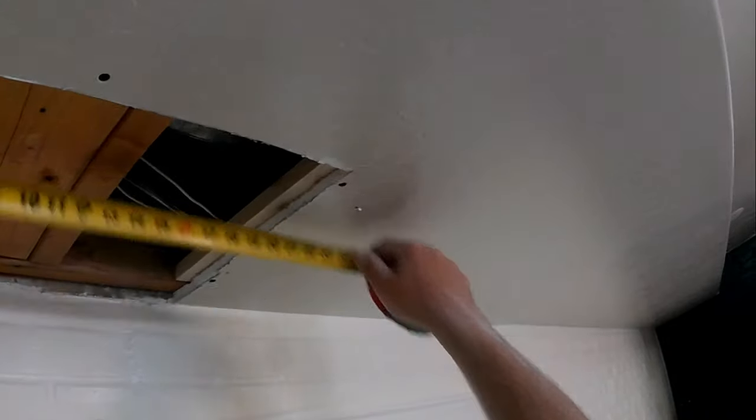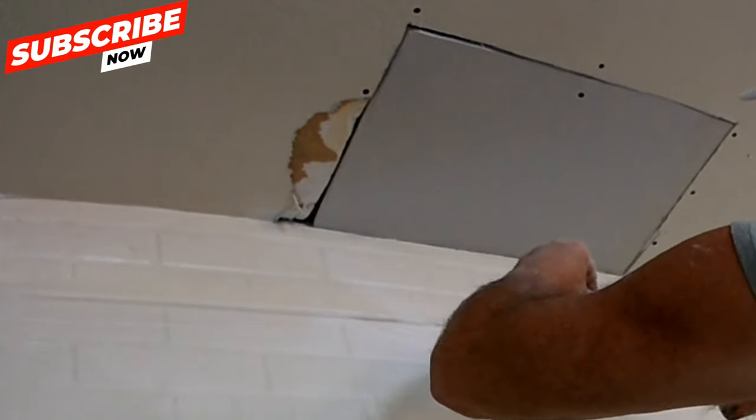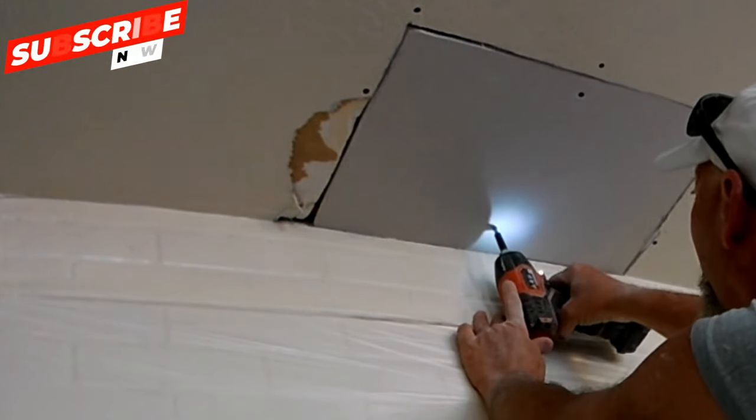Once you get it all patched in, add plenty of screws — screws on the existing studs, screws on the outside edge of the old sheetrock. One stud in the center of a patch is not enough; you need one on each side. Every job I go to, they just put a screw in the center, then we have to take the screw out, take the patch out, and add wood backing. For smaller patches like a six-inch patch you can get away with one stud in the middle, but for one-foot or two-foot patches you need studs on each side to keep everything nice and tight.